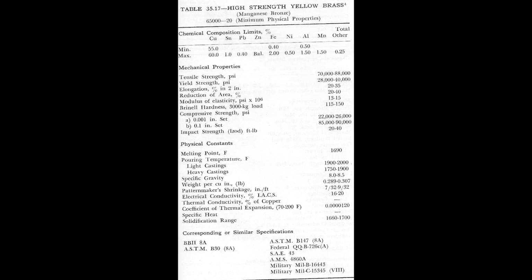To the gating and risering systems for individual castings. Reference should be made to reliable information available on gating and risering systems recommended for this alloy. Chills may often eliminate the need for excessive risering. However, because of the drossing tendency, care must be taken in the proper use of chills. Choke gates, strainer cores, and pouring basins should be arranged to allow the metal to enter the molds without turbulence.